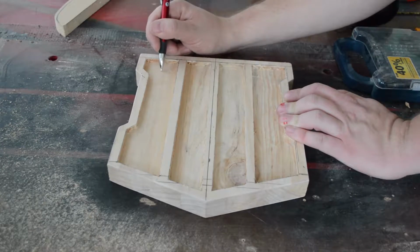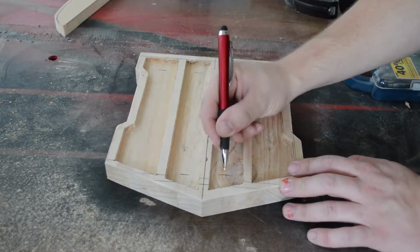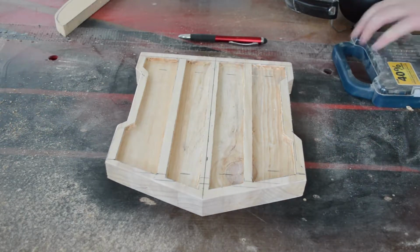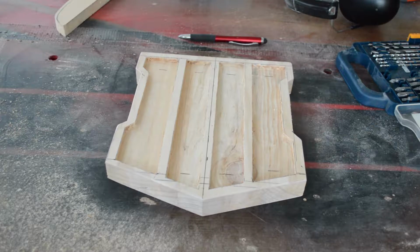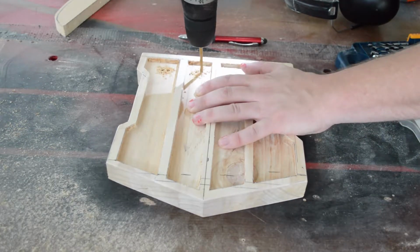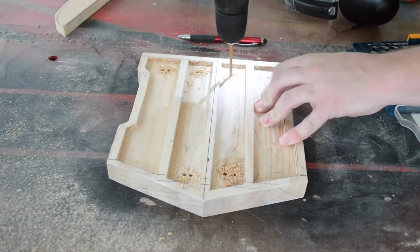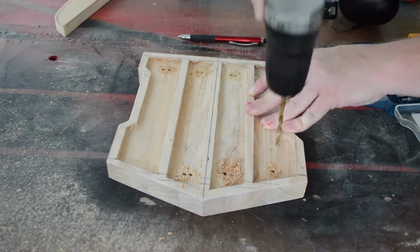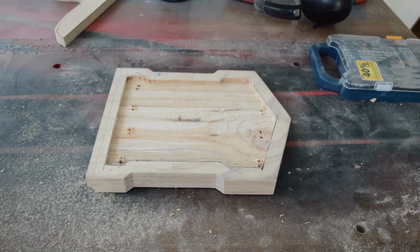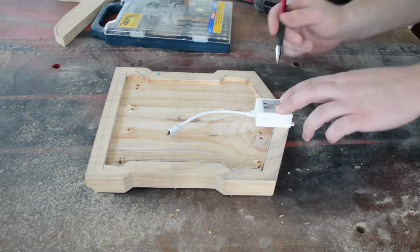So here is an example of when laziness creates innovation. Or well, necessity, rather. I was going to cut each LED strip to the length to fill the recess. But because these LEDs have red, green, blue, and white, there is an R, a G, a B, a W, and a plus contact on the strip. So if I were going to wire them in sequence, or series, I believe is the proper term, I would have had to run 5 wires between each strip 4 times.